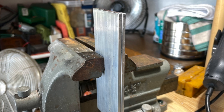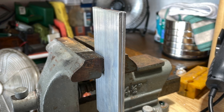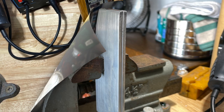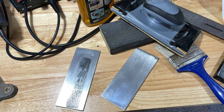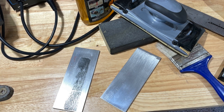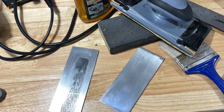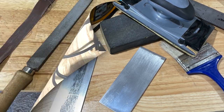And this is what I did. This takes you the longest part because trying to file it down, because your hacksaw is not going to make that great of a finish once it's done sawing the two pieces that you need. Okay, as you can see here, both pieces have been sawed and trimmed down and they're square. Now all I'm going to do is be sanding them down, giving them a rough finish because I'm going to be painting them. But you can cosmetically make them look any way you want. You don't have to paint them. You can just keep sanding them, make them that way if you want.